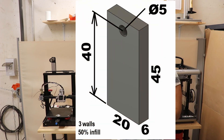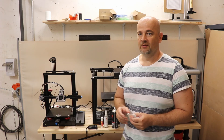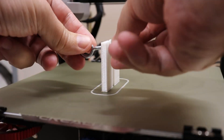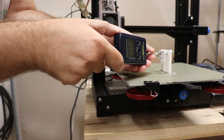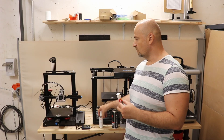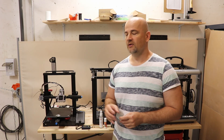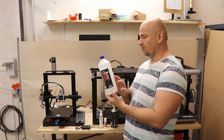How can we compare these three? I have a test object — the base surface is 6 by 20 millimeters — and I will use this hanging scale and try to pull it to the side to measure how much force I need to remove the object from the printing surface. Using adhesion materials like glue stick or hairspray is important, but I don't want to use any of them. I will use the same G-code for all three surfaces and clean them with isopropyl alcohol.